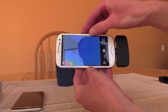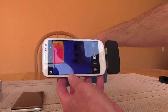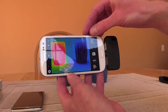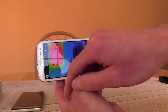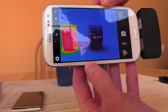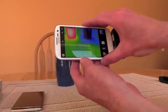I'll turn it this way so it points out a little better. This is my second pass at this video, so this one has cooled down a bit and this one has warmed up a bit — but hopefully you can still see a delta there. As it starts off, even though it's showing you an image, it's still calibrating. They have a little spot sensor you can turn on, and if it says 'about' a certain temperature, it's still calibrating. After about 20 seconds, that 'about' symbol goes away and you know you're good with the temperatures it's showing you.